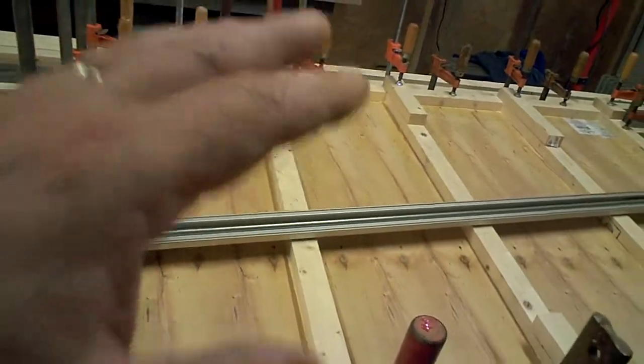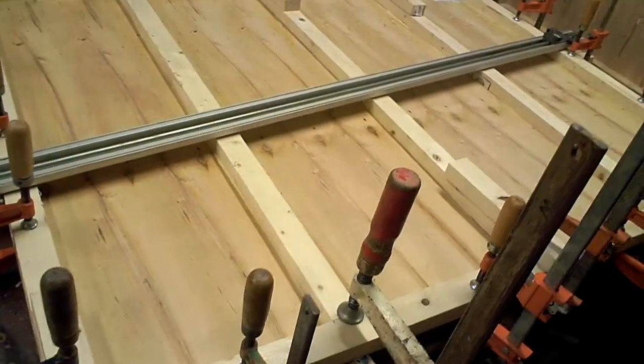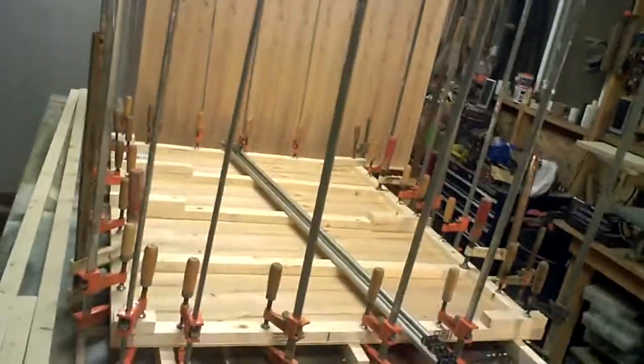This whole floor unit is going to sit on top of a pressure-treated 2x4 grid — I'll make like a little base and it will all sit on top of that, anchored in gravel. This is basically just to get the insulated shell. I could have made it with pressure treated throughout, but pressure treated does not take glue very well, so I would have had to screw everything, and screws without glue just don't hold up.